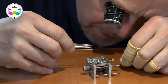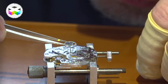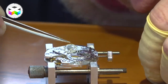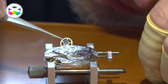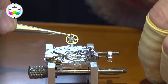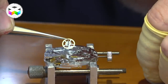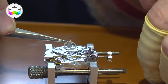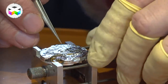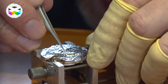To continue dismantling, we will now remove the chronograph wheel — the wheel upon which the chronograph hand actually sits. You have the cam at the top, acted upon by the hammers to return it to zero. There is a small spring underneath, which pushes around an intermediate wheel to turn the minute recorder wheel. So every 60 seconds that the chronograph wheel turns, it couples with an intermediate wheel which turns the minute recorder wheel by one minute. It sits upon this small spring with a small nylon ring, to take up any slack between the triangular-shaped teeth around that wheel.